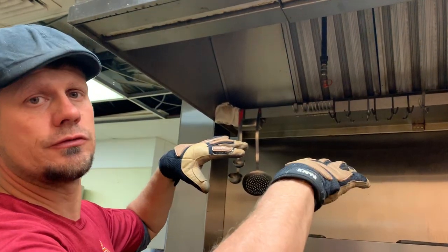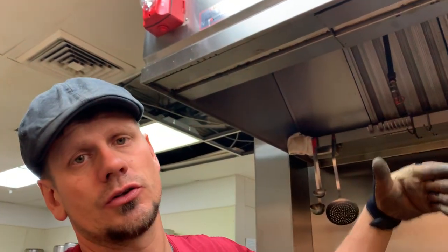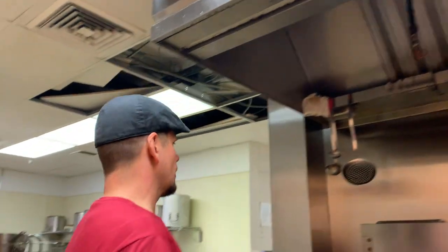Then the makeup air has to shut off. It's dark right now up on the roof so I can't go up there, but the swamp coolers have to go off as well. We have to keep the exhaust fans on, and the last thing is the lights underneath here have to kill too — and so we got all that wired up.